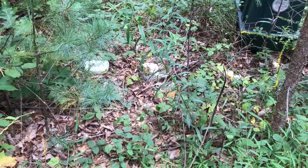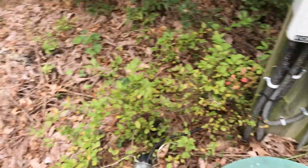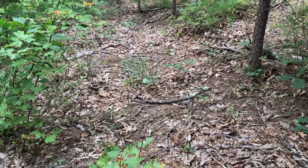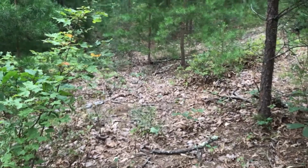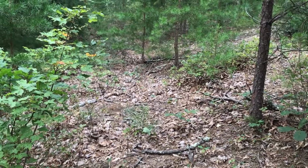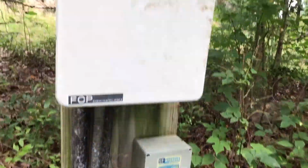And once that stuff has been eaten, then the clean water or the gray water comes over to this tank right here, and through a series of pumps is sent up that way and goes uphill and then goes through a bunch of loops where it comes back down to the same return line and back into this tank. So it's on a cycle or a timer so that the pump will run, sends the water upstream, the soil absorbs what it can. What it can't, it sends back down, and then it sends it back up again. This is the system itself.